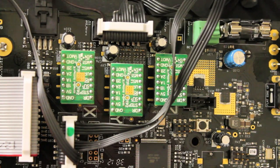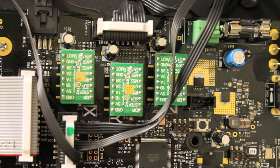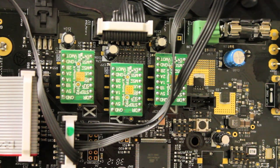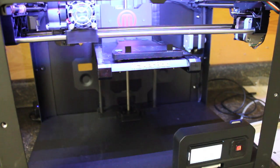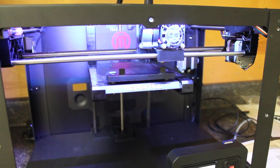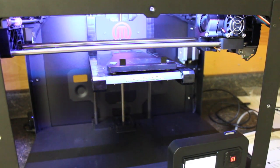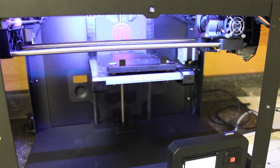I've switched the Bot Steps on the Mighty Board. I'm going to flip the MakerBot over and try to level the build platform to see if the X axis now moves. I'm running the build platform leveling script — and lookie there, we have movement on the X axis. So that tells me one of the Bot Step boards is bad. We don't see any movement on the Y axis, so that's indeed the problem.